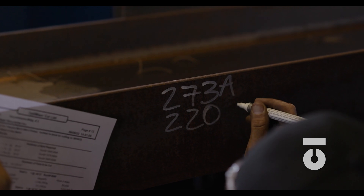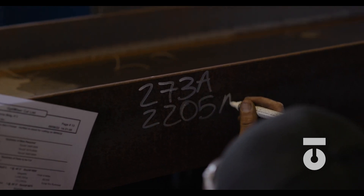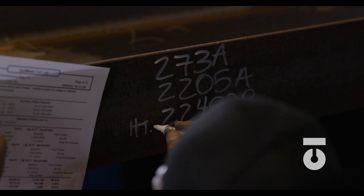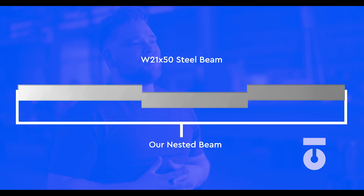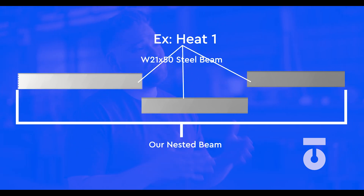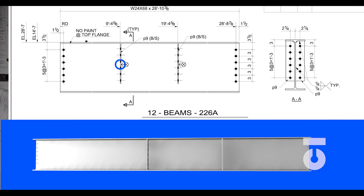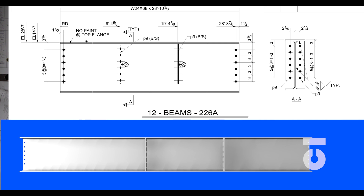Once our raw W21 by 50 by 44-foot beam has been cut to length to form the beginnings of a member for an assembly — according to a cut list that correlates with our assembly drawings — we need to re-scribe the steel with its correlating job number (e.g., job 2205), ship mark identifying this member as the beginnings of an assembly, and potentially the heat number if cutting multiple members from one long piece of steel. Traceability markings can be easily wiped off as steel moves through the process, so material is always being checked and re-scribed with correct markings throughout.